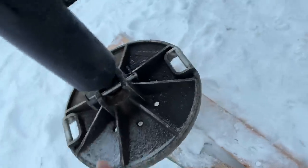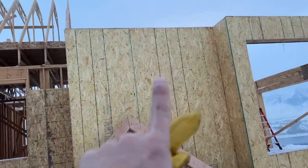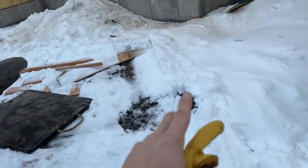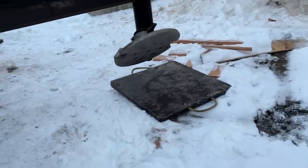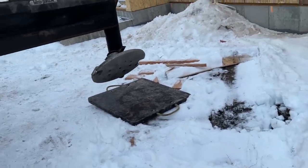that was clutch. His big concern here is because of the weight and outrigging and how far of a reach it is, he's worried about this outrigger coming down into soft stuff. And luckily, we did excavate a ton here, but right up where he's at is kind of untouched area, and it's been really well compacted because of the 400 plus yards we moved in the backyard.